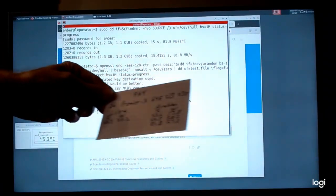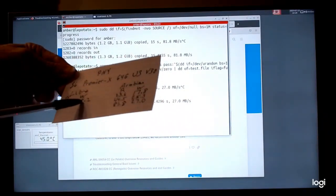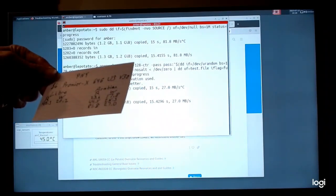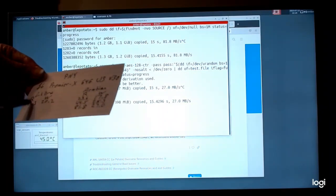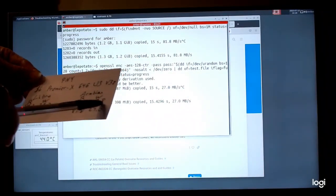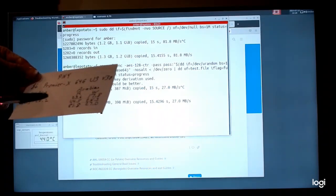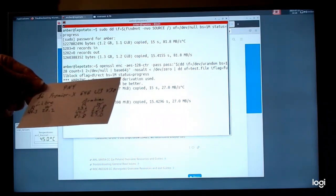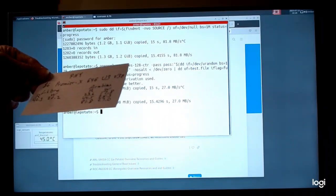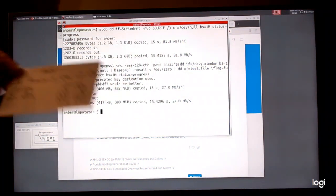Libre Computer with their Ubuntu distribution right there, 42.3, 20, and that was, see, when I was starting out, looking at my Armbian, I noticed that was much lower than the Libre Computer. I was wondering why that would be, and so I was looking at the device tree. If you put the same one over there, it's kind of similar, but then if you go up to the next higher mode, the sdr104, you almost double that read speed. Still increasing your write speed right there. And same card. But anyway, that's what I got right here.